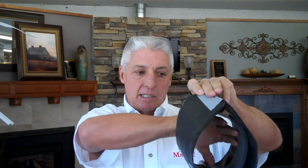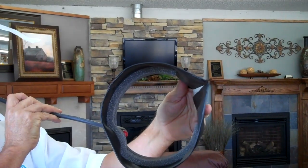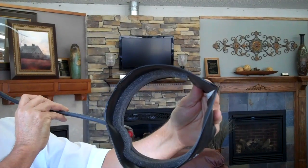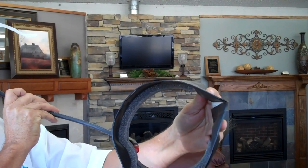We put it together like this, it will slide in your ductwork, and when air pressure builds up, it will close this off. Here's one — before I put it in the ductwork, I'll show you how it works. You can see through the balloon right now, and as I blow through the hose, you'll see it will close off.